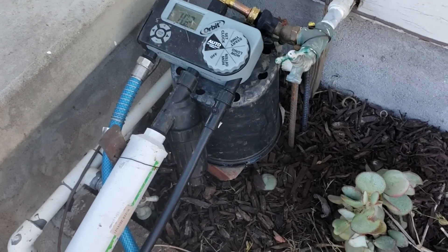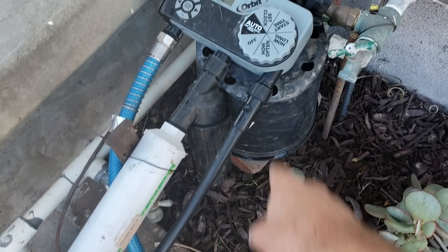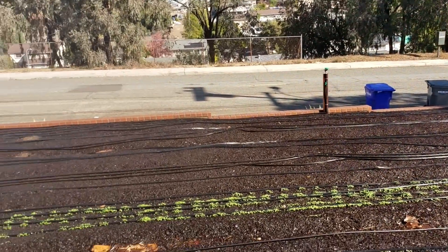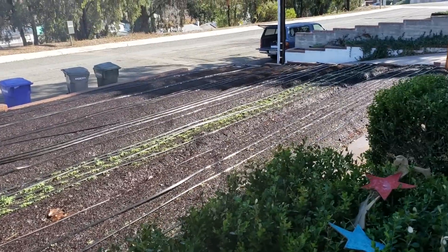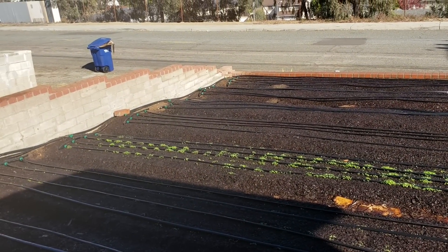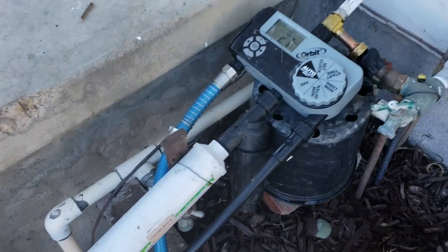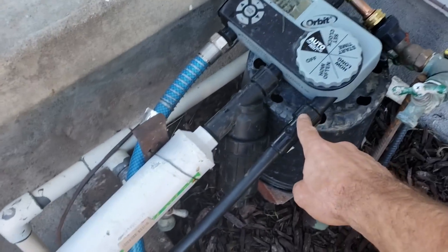Let's take a look at the sprinkler system and how it's all set up. The sprinkler is running on half inch poly, though three-quarter inch would be an even better size to run for more water volume. Because this is such a small piece of property — about 1,200 square feet — I was able to do it on half inch. But for anything larger, go with three-quarter inch. That even goes for your drip system: anything 2,000 square feet and larger, I'd recommend three-quarter inch poly so you don't have to run as many valves.